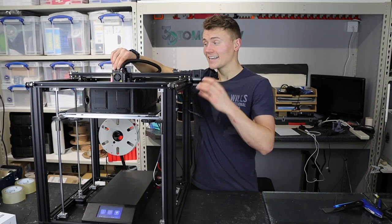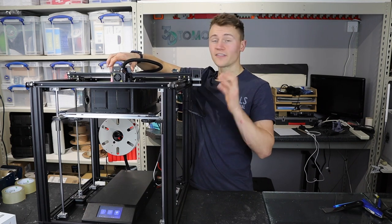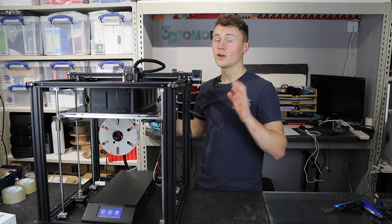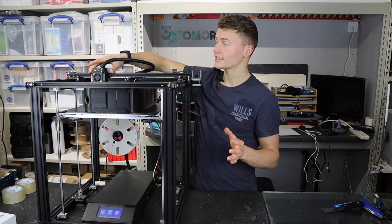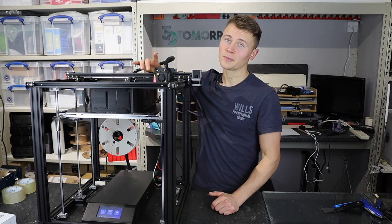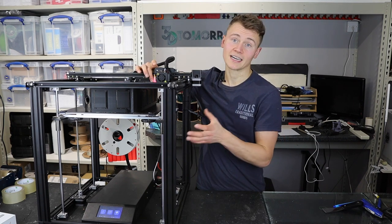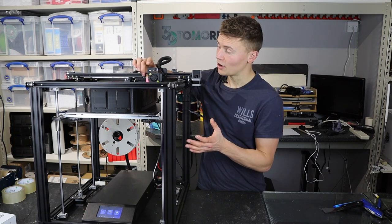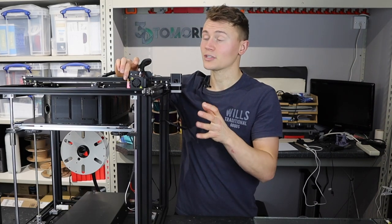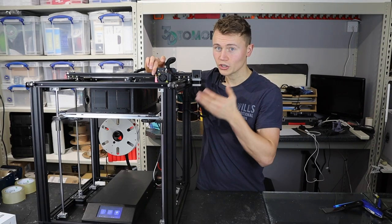But we're still on cons. Setting the eccentric nuts on this machine is quite an important step — I found it quite sensitive to how they are tightened and was getting some skipping steps to begin with where it was either too loose or too tight. Another problem I've noticed quite frequently is the reliability of the BL Touch sensor. I find them really annoying; I prefer to manually level a bed. Because of the BL Touch's unreliability — sometimes it just won't work and leaves your print starting way off the bed — you have to watch this printer when it starts.